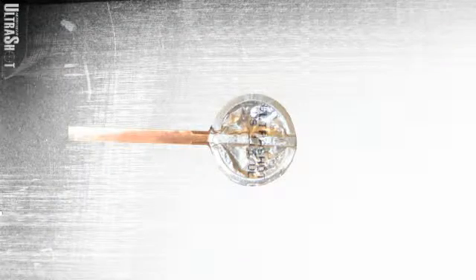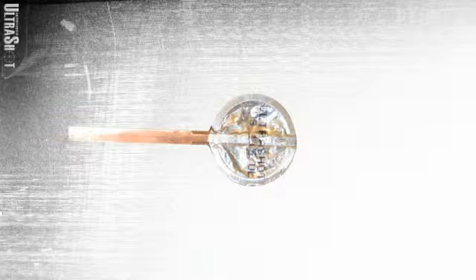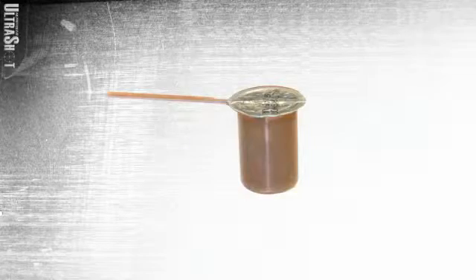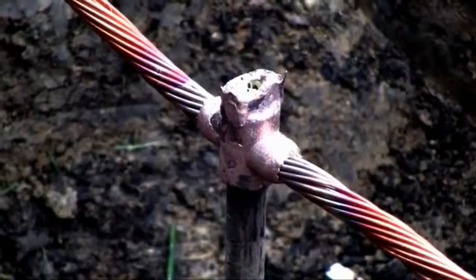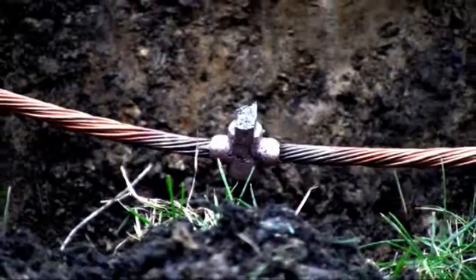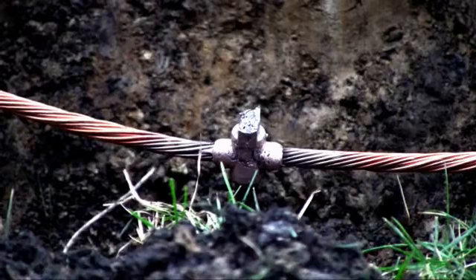The cartridge is hermetically sealed with an aluminum foil that also becomes part of the connection. There is no starting powder in the weld metal. This lends to a brighter, cleaner, more reliable connection and a weld metal product that is much safer to transport.